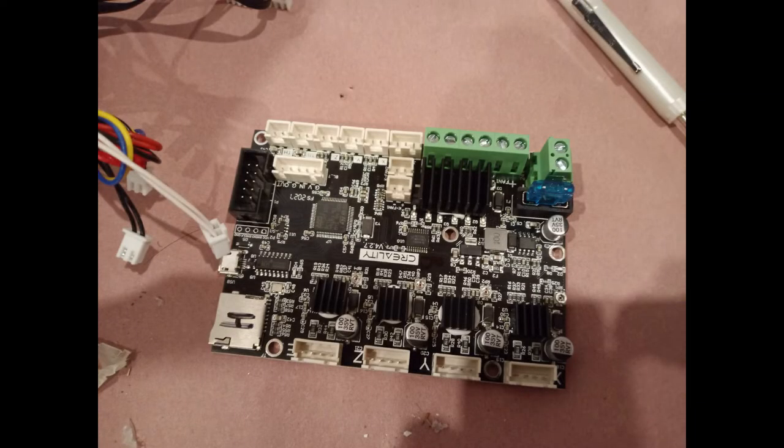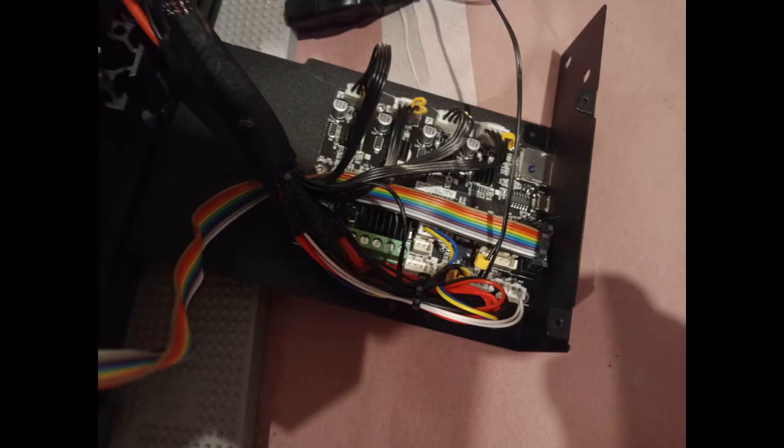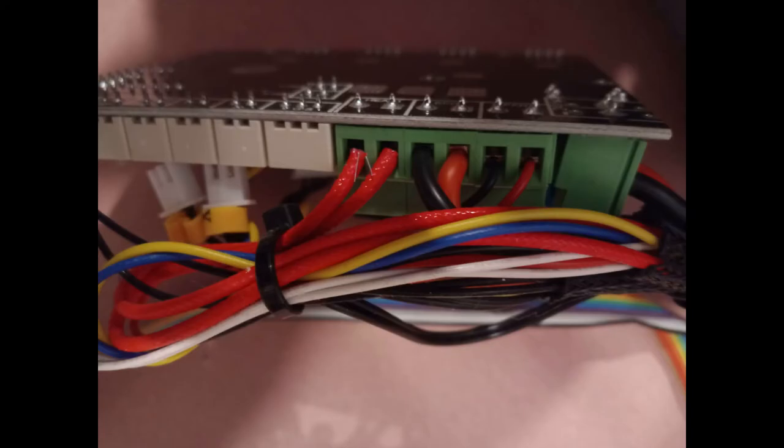We next suspected that one of the motor controllers died, and since it's a surface mount component, I decided it would be beyond my expertise to desolder and replace it. Instead, I bought a new 32-bit control board, which would also make the motors much quieter. These photos document the removal of the old board and served as a reference for which wires went where.